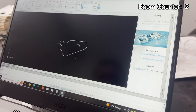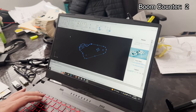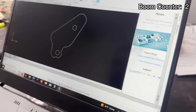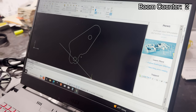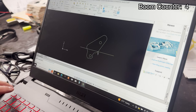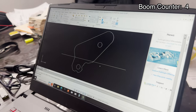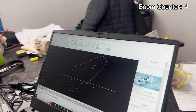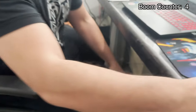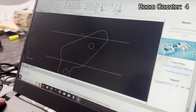All right, we're here on my screen. This is kind of the outline of our FLP kickstand — this is what we use for the water jet cut. We're going to turn this over because we usually cut them off backwards, then start messing with this. We're going to draw a center line to mimic the swing arm. So now it's all centered and we're going to pretend that this is our swing arm. We're going to measure its height — we're about two inches, 1.970 — so we're going to offset that line by that amount. We know this is the top of our swing arm and we don't need all this excess in there.